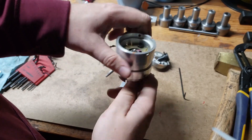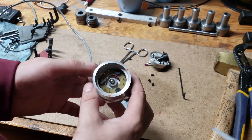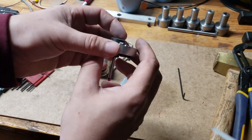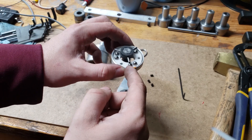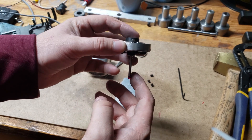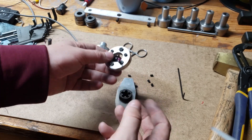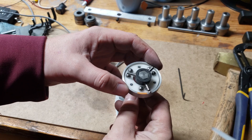I'm really struggling to get this apart, so I can't show you the inside fully. I'll release another video on the design of the new probe. I've crashed this thing so many times and wrecked a lot of probe tips, so I want to incorporate a maximum travel limit with another switch wired to the e-stop — so if your machine controller doesn't pick up the probe touch and just keeps going, when it hits that second switch it has no choice but to kill the machine, or wire it into the stop function of Mach 3 or LinuxCNC. Hopefully that was helpful.